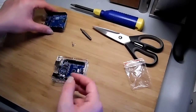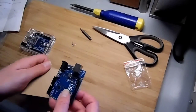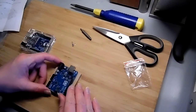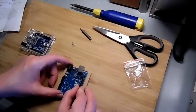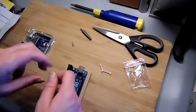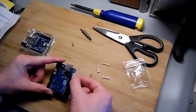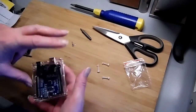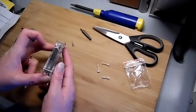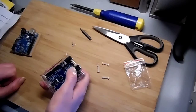You use a reset from time to time — it's a handy feature. I did make myself a little stand for this, mainly so it's not sitting directly on a surface — these edges are sharp, but not that sharp — it's just handy to have it knocking around. I got these M2.5 nylon nuts and bolts, and they're just a little bit too fat for the clearance here. So I need to re-solder that header pin, take it apart, which is going to be fun and games. Just give the header pins a little bit of tension and flash your solder iron over it, and that should be fine. I haven't really bothered until now.